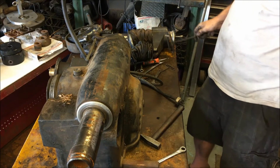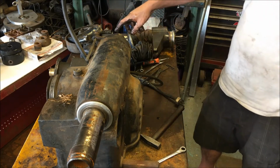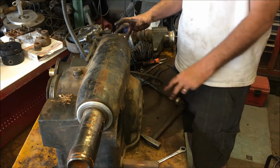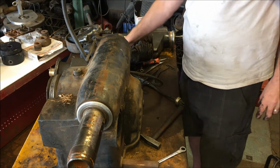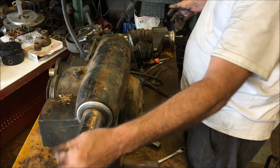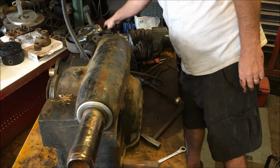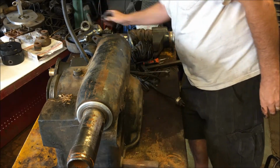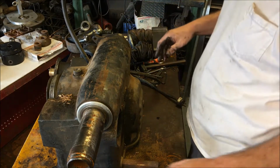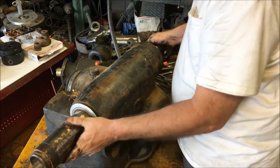Normally, that whole thing comes apart without having to take the whole gearbox apart. I could just remove the spindle lock, remove the set screw from there, unwind this all the way, and it'll slide right off. Sometimes you have to put the drawbar back in there backwards and tap it out a little bit to get it to jump off the end, but that's basically it. And unlike IKEA stuff, there's no extra parts on this machine. Don't lose nothing. Can't lose any of this stuff.